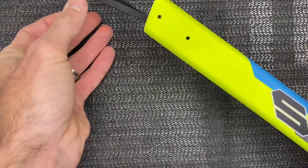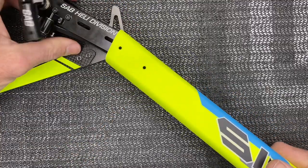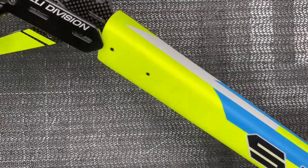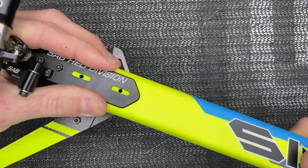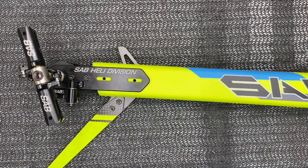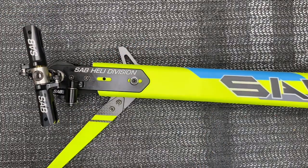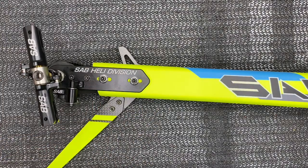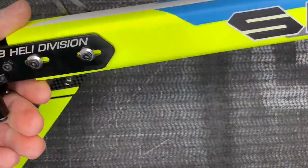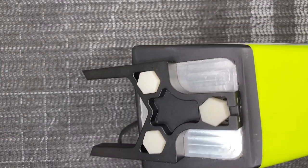Simply push the belt all the way down and it will come out the other side. It's important not to get the belt twisted up — we can fix that later. Now the belt is coming out the other side. Carefully slide the boom in between the casing and loosely put your screws in. Don't tighten these up yet — slide the casing all the way forward until we get the belt on, then we'll tension the tail belt properly by rocking left to right. Put all four screws in and push it all the way forward so it's as loose as possible.